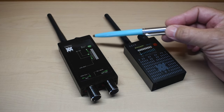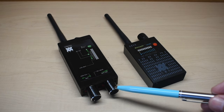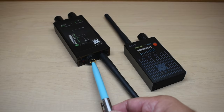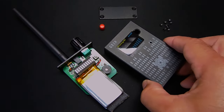The M8000 is just a little bit longer than the G318, but the width is the same. There's an additional knob compared to the G318. On the very top, there's a quarter-inch or six-millimeter jack that plugs directly into the top of this unit in order to perform magnetic testing. Let's open up this unit first — here's the extruded aluminum housing, empty, and on the left you can see the circuit board.